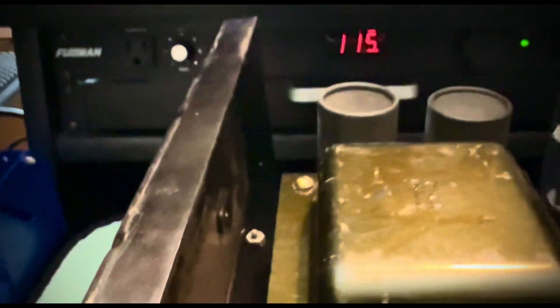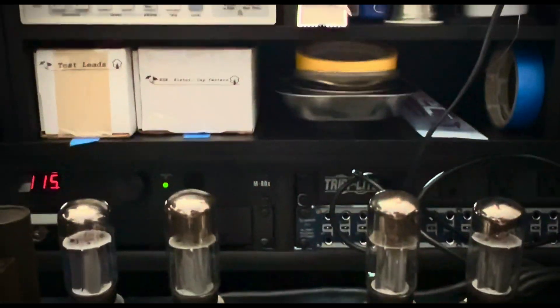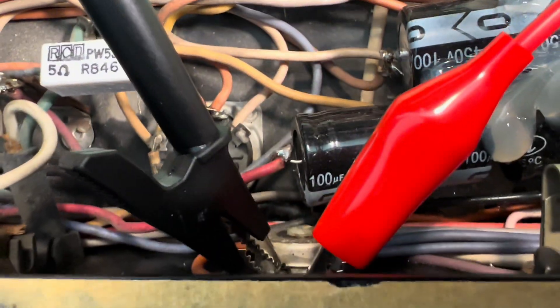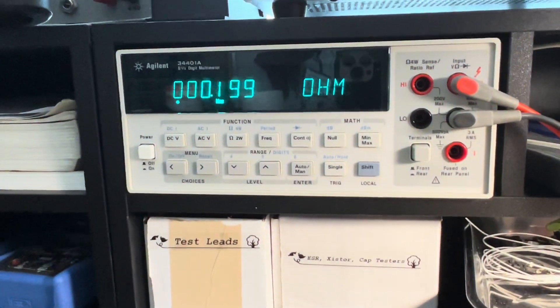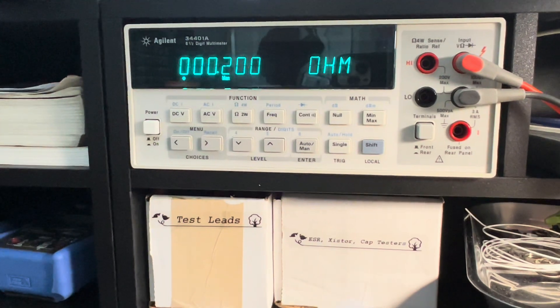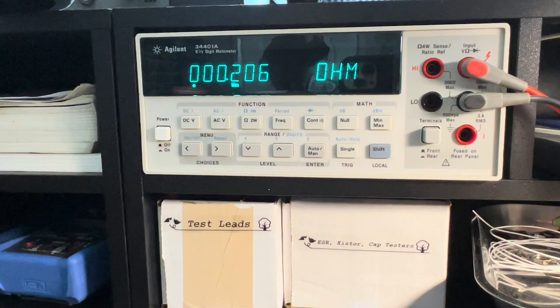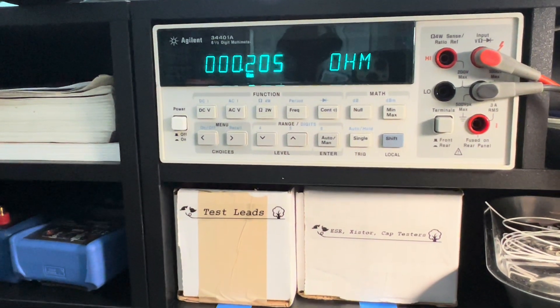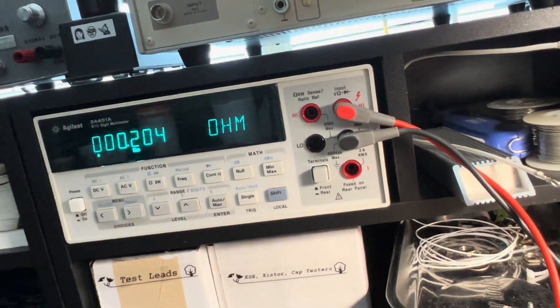I should say removing these. PG, folks — mind out of the gutter. So anyway, this is where we're starting this thing off. Hope you guys are doing well out there. All right, Mohammed — one of the issues with your amp is that your HumBalance pot has failed and is not adjustable. So I'm going to replace this with an artificial center tap comprised of two 100-ohm resistors to ground.